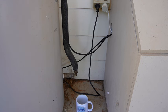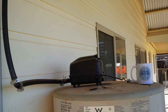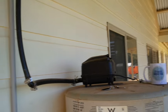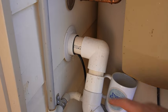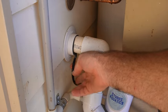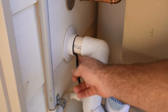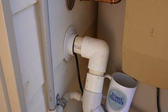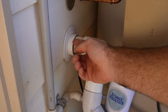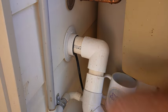There are two leads that come off that inverter. One lead runs up to my pond air pump - I use the pond air pump so it can be outside to reduce noise inside. It's weatherproof, has a really long cord, supplies plenty of air, and is just plumbed into the wall. The other lead sneaks up behind the hot water service and using the existing hole for the drains goes in through that flange inside to supply any internal or canister filters, so when the power goes out they don't go out as well. There's a bit of sticky rubber around there just to seal it all up nicely.